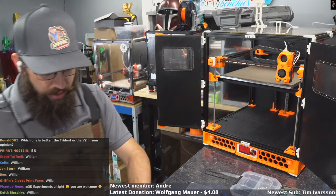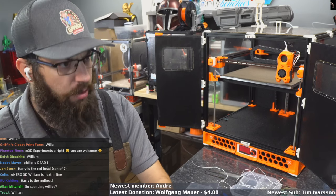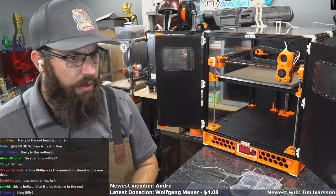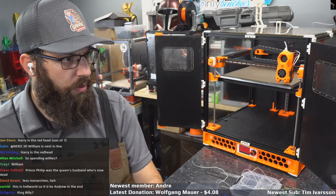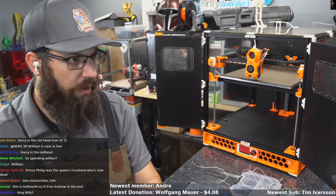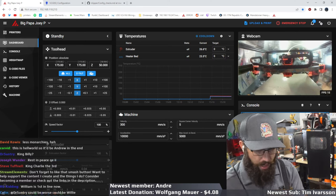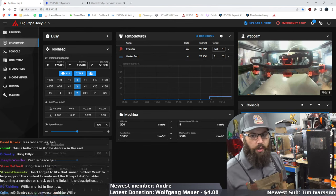Okay, let's PID tune this guy. PID tune. So, PID settings, PID calibrate. So, we are going to move you X. Actually, this is 350, right? 175. Y, 175. Z, 50. PID tune, calibrate, and we're going to calibrate at 240 because I normally print ABS on this machine. So, we're going to PID tune at 240. See how quickly that ramps up.